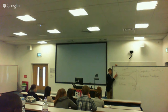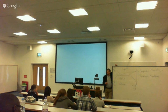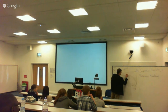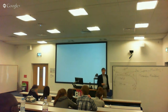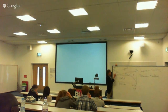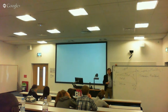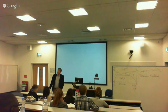What have you got here? I call it a mushy zone, a mixture of solid and liquid. And here the same. Here you have all solid. Between these two, remember, a zone that is made between two different zones is made up of those two zones. This is called an equilibrium phase diagram.